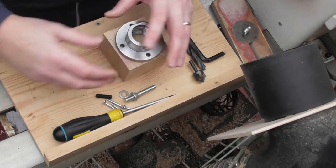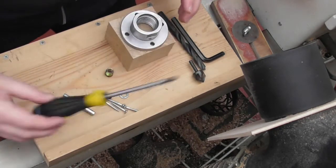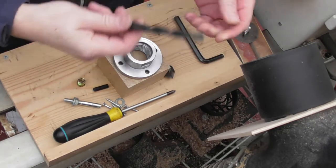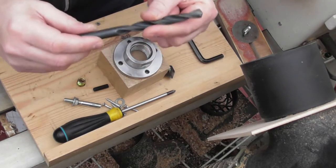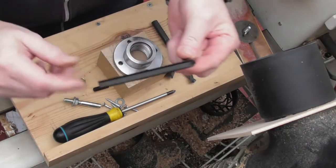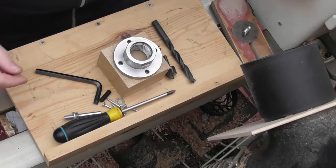I'm going to bring it back to the lathe and show you how we insert the wood screw and get it all level, trim down the right side, and how we can then mount a bottle stopper blank in order to turn it. The other tools I've got are a screwdriver and screws for mounting, a countersink for the wood insert, an 11mm drill bit — some people say 11.5mm and we sell both; it depends on the type of wood. I've always used 11mm. And then I've got an 8mm hex key which fits in the wood insert screw when it comes to finishing it.